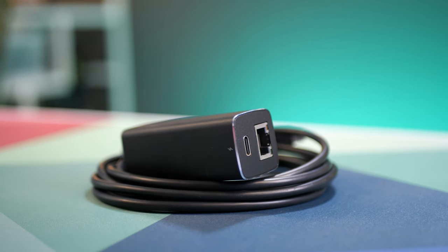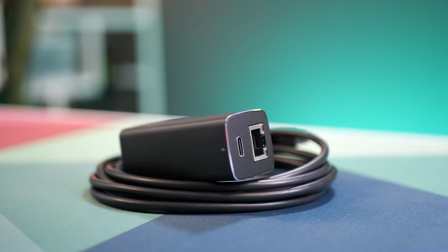The first thing you'll want to do is make sure your OBSBOT Tail Air cameras are on your network. You can connect them over Wi-Fi or Ethernet. I would recommend, if you can, get the wired Ethernet adapter that OBSBOT sells and actually plug these in to give your cameras a wired network connection. It'll give you a more stable connection, and it can also power the camera if your Ethernet is Power over Ethernet. Once you plug in the cameras to the Ethernet, it'll get an IP address on your network. This step, as always, is the most complicated part — finding the IP address of these devices on your network.